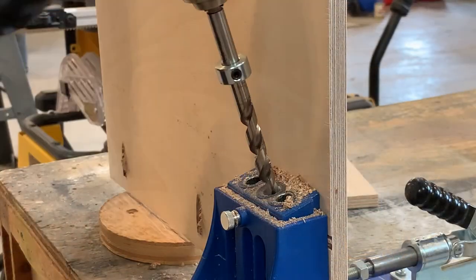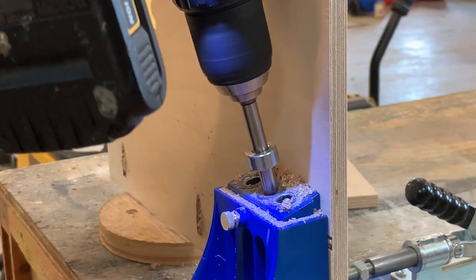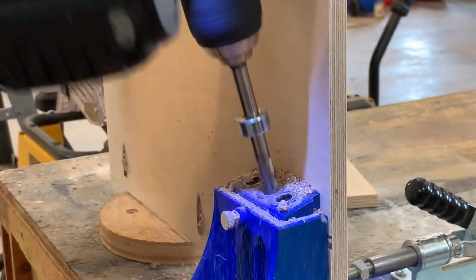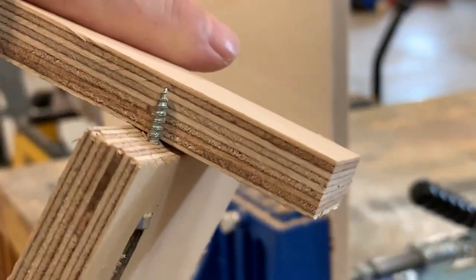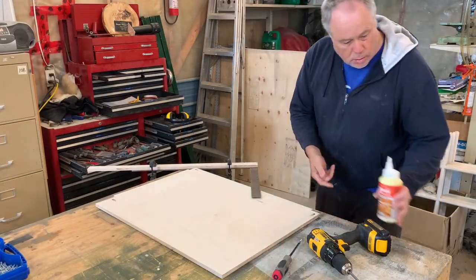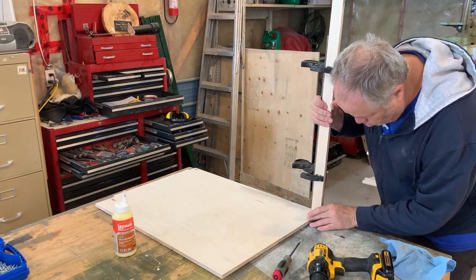Like the kitchen cabinets, I'll be making extensive use of carpenter's glue and Kreg pocket holes. I have the collar set up for half-inch plywood. Here you can see how the screws penetrate the wood. The real strength with Kreg's system is that it allows you to screw across the grain and into the face of the plywood rather than into the end. Here I have a square clamped to the first piece to ensure it stays straight while the glue sets.